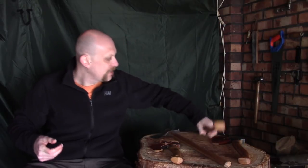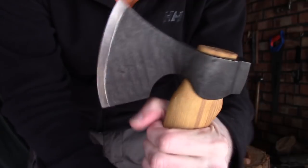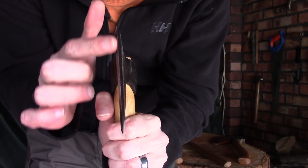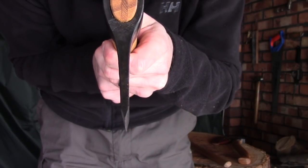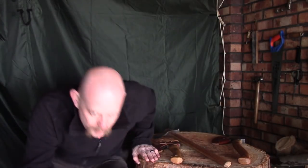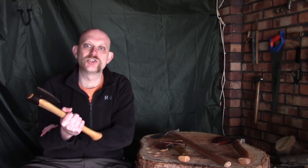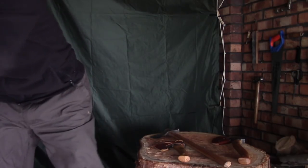The next one is the Hans Karlsson Sloyd axe — you may have seen my video about this just before Christmas. It's fairly new to me but it's a lovely little carving axe, and again it falls into the category of dedicated carving axe. It's got a symmetrical grind, so you have a mirrored bevel on both sides — you can see from the cross-section that the two sides of the blade match each other. It's a lightweight axe with a slightly longer haft, and I can sit there for a good few hours using this without my arm getting too tired. It is the most expensive of the four here but it's really really nice.